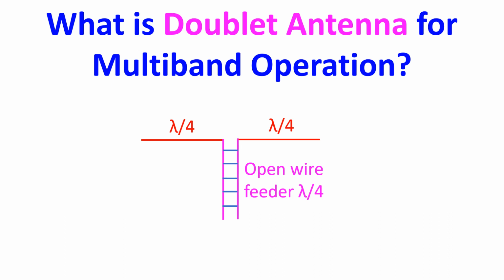VU3 TPW has used 4:1 and 1:1 baluns in series, connected to 1.5 meter RG213 cable leading to the antenna tuner. It is worth remembering that a balanced open wire feeder cannot run through a building and needs a transition like the RG213 cable into the building.